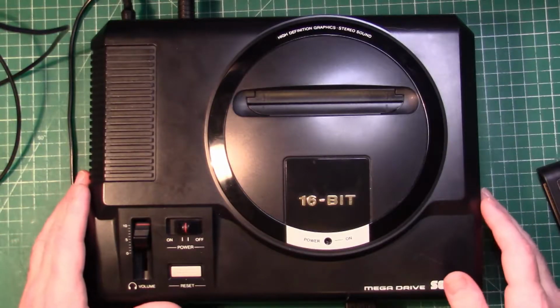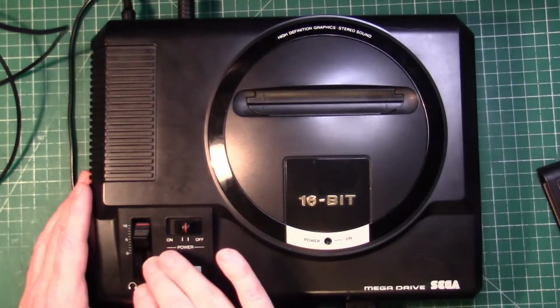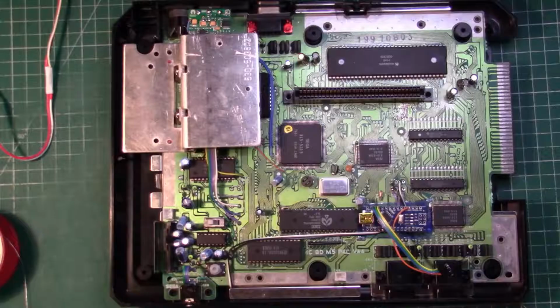So I'm concerned the video is still noisy. We still have jailbars and I expected the picture quality to be a lot better. First, I removed the connection to the stereo jack, suspecting that it might be acting like an antenna. Needless to say, that didn't really help.